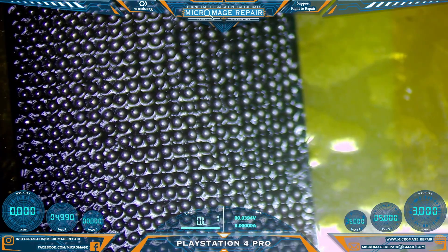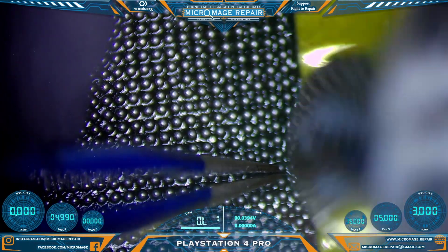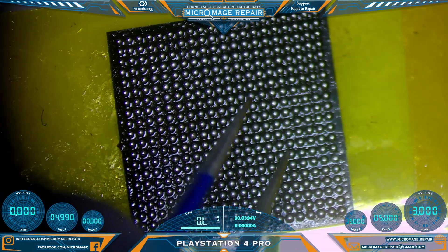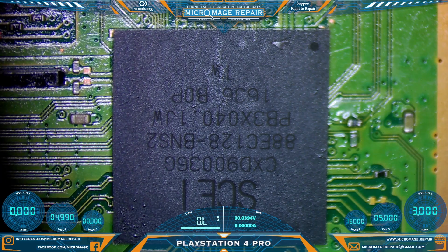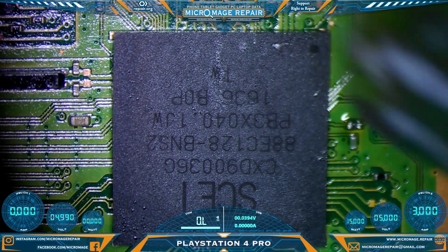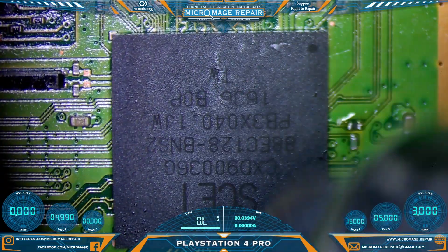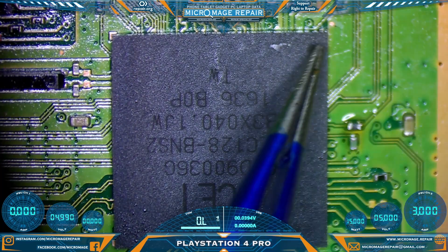We're back at 380. Excellent — that'll work. I put this back on the preheater and I'm warming it up. We're prepared to attempt to tack down. We'll be coming at 480 at 20 percent airflow — we don't want to blow the chip off. We're just trying to tack down maybe a corner. I'm not trying to flow the whole chip into place, I just need a few balls. We're already tacked down.